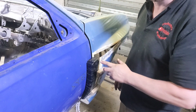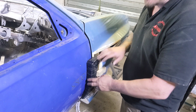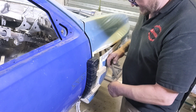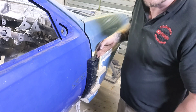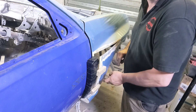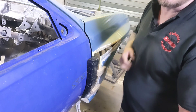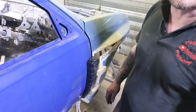I'm doing this side first. What I've done is mount the block in exactly where I need it, so the chamfers will line up with the edges and we'll get the recess right. I've blocked it in so it's got a bit of firm. All I'm going to do now is literally just start laying fiberglass up on the inside here just to firm it up. Once I've got the shape of this firm enough, I'll take the blocks off - this will hopefully hold its place - and then it'll be a matter of bombarding it with layers and layers of fiberglass just to reinforce it.